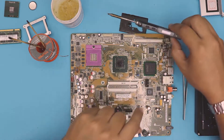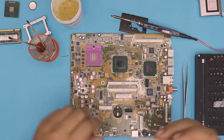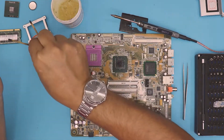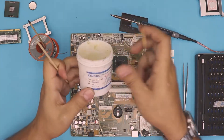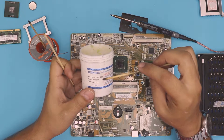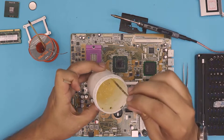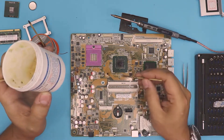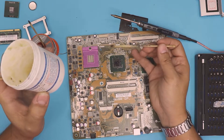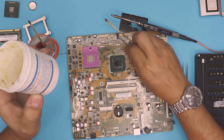We're gonna wait for it to heat up — it's at 110 and going up. While that's heating, we're gonna apply a flake flux. You can use a different type of flux — I'm using a 218. Let's grab a little bit of flux and apply it right where the riser has to stay. Remove the other one and apply flux right there too.